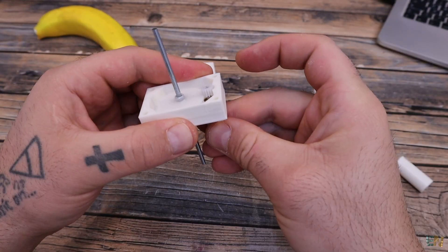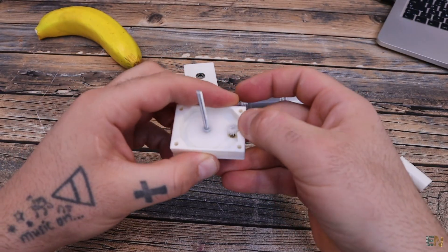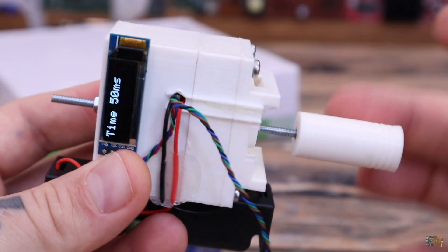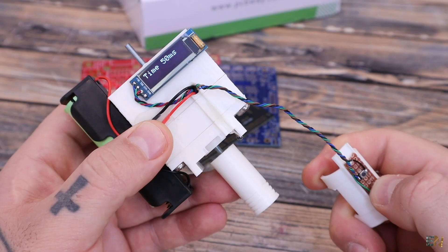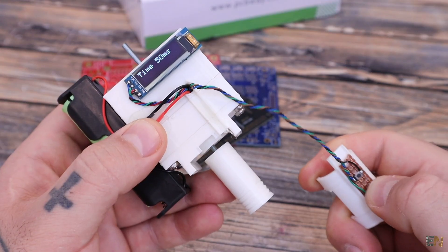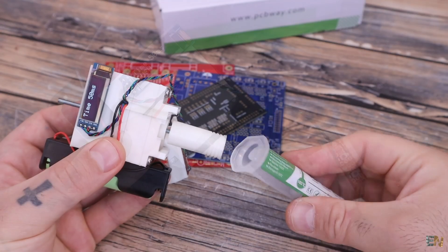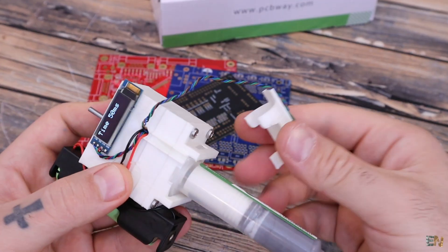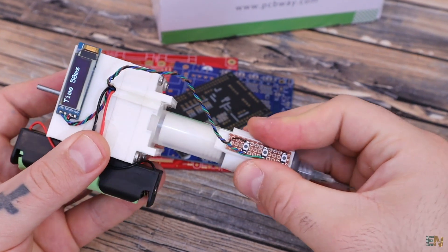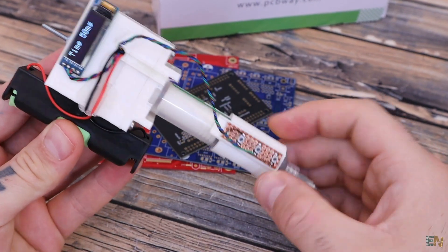The motor inside is connected to a screw that goes inside of the plastic piston. The piston has a threaded insertion so that when the screw rotates, it will push and pull the piston, moving the paste inside of the syringe. Just fit the syringe on the piston, rotate it 90 degrees so it gets locked in place, clip the button 3D printed part in place, and then just push the buttons.